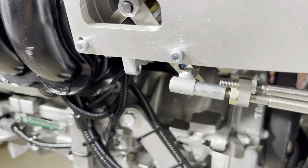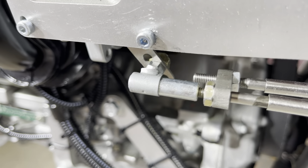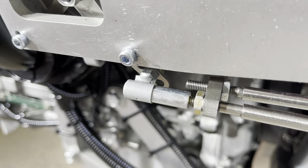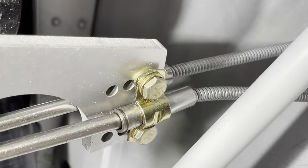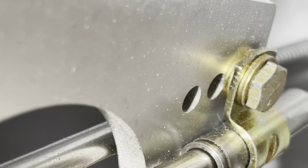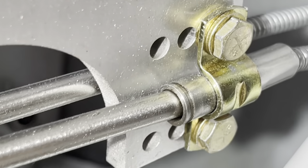You can watch the cables move your throttle — in this case a dual throttle. There's a piece of stainless steel that's threaded with two 10-32 holes, and the second cable is screwed into it and then jam-nutted — it's just on the back side of the original. Also, there's a washer in between the clip and the aluminum. That's so that when you torque it all down you don't mangle or bend the clip. The washer gives it just enough pressure to securely lock it in with that little groove.